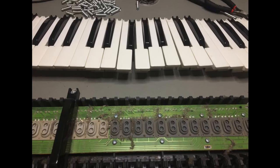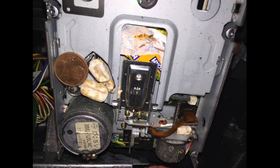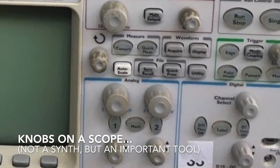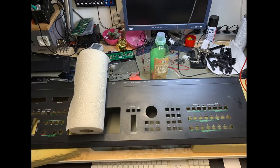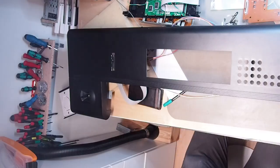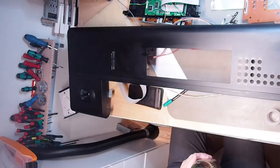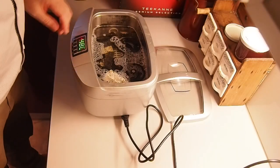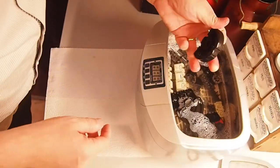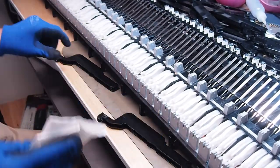Before we go to number one, an honorable mention. It's not a fault as such — it doesn't stop your synth from working — but synths need some cleaning. Of course it doesn't stop working when it's covered with dust, finger grease, spit, sweat residue, beer, mucus, snot, mice droppings, dandruff... man, synths can get dirty. Cleaning can actually be a moment of zen in the whole restoration process. To clean surfaces I just use a paper towel dampened with normal household cleaner. To clean button caps, mod wheels, encoder knobs etc. I use my ultrasonic cleaner bought cheaply on eBay. To clean the keys — the things that need cleaning most — I also use paper towels dampened with household cleaner, and for troublesome spots I use isopropanol alcohol.